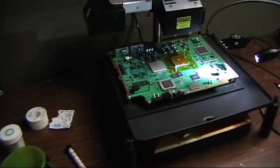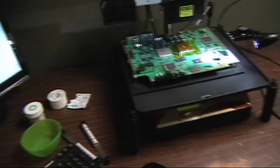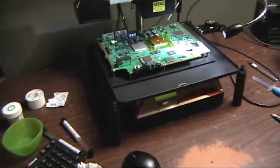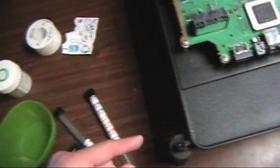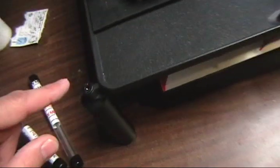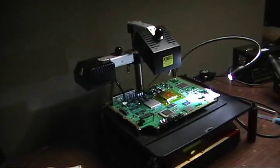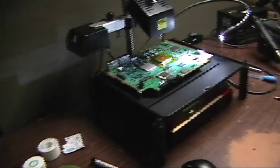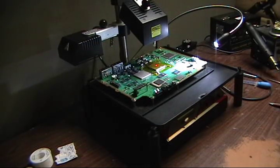So what I did was I took the Presto board — it's just a board that you can bake pancakes on, bacon, eggs, whatever you want to do. I bought it at Target. I took the legs that were on the Jovi XY table that you can see right there and I put them on this. Basically I had to take the plastic that was around the Presto board off, and then I had to drill out these holes so the screws would fit in them. Then I just used the legs that were on the XY table from the Jovi. I've done a couple of these already, and this method is keeping the board completely flat because the board is staying completely heated on the underneath evenly.